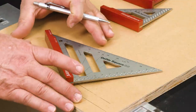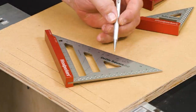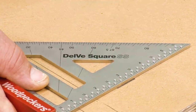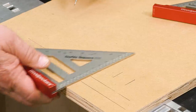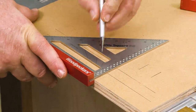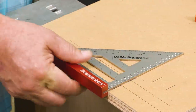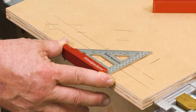Another feature of the big version of the Delve Square are the cutouts, which give you standard measurements. Right here, this is one inch from here to here and from here to here, so if I need two lines an inch apart, there they are. If I need those two lines at 45 degrees to each other, there they are. That's one inch; this is three-quarter here and here, and this is a half inch here and here. The little stainless has the exact same thing, but each one of the cutouts is a half an inch.